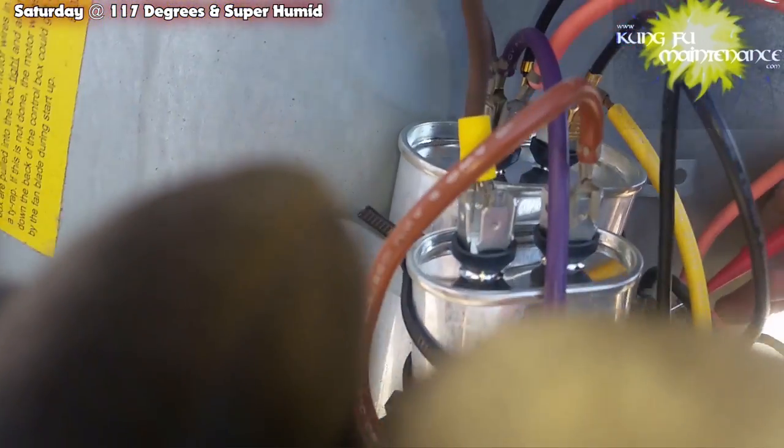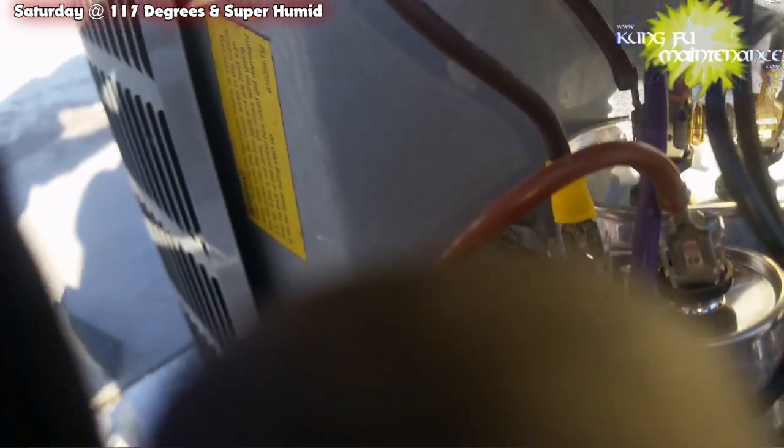What I'm going to do is get in right here to the wire itself instead of the conduit, and the same thing at the compressor. We've got continuity there, but if I go on the terminal — no continuity. Be careful. That's our problem: we've lost the terminal.